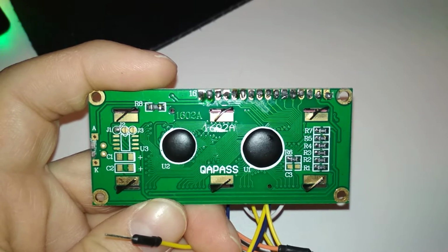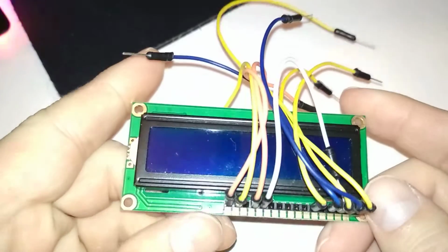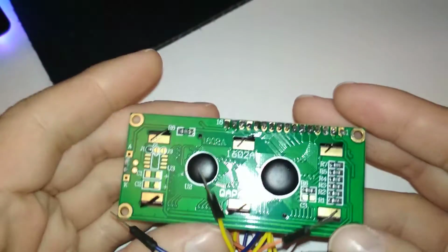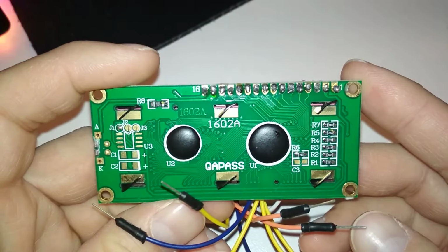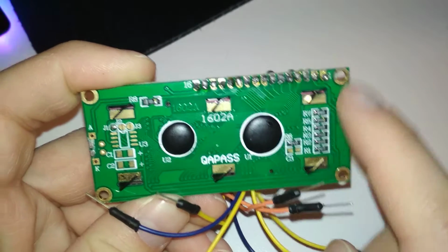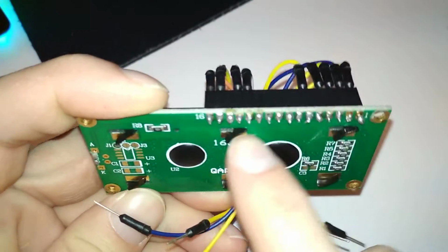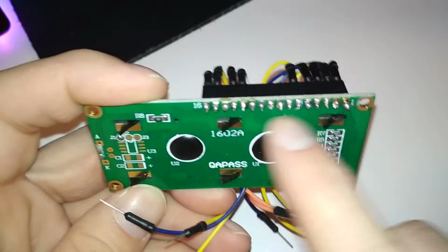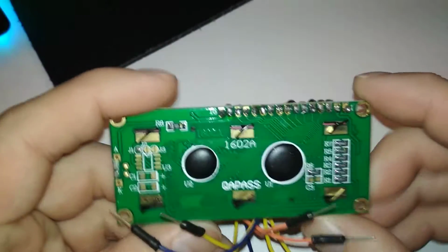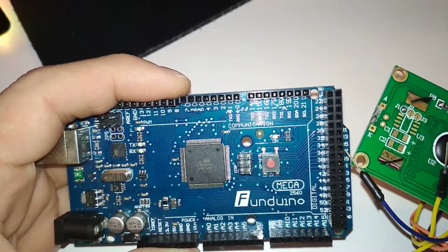So I started researching this thing, how to build an Arduino thermostat with a screen, and I realized that I'm missing a part. Well, it's not very important, but there's a circuit board with a chip on it and some other stuff that converts this input, like 16 pins. Yeah, it says 16. 16 pins converts them down to 4 digital, I assume, to 4 pins here.